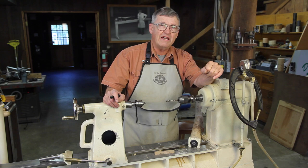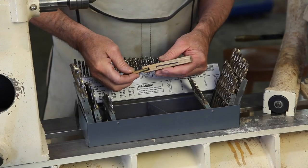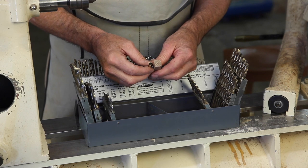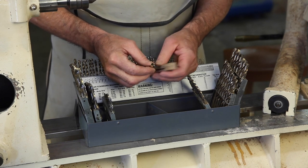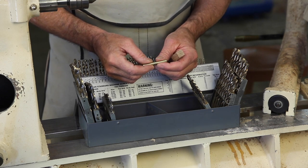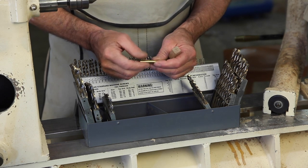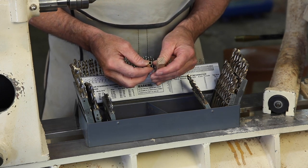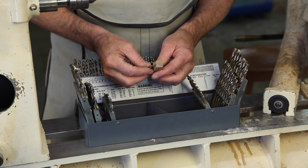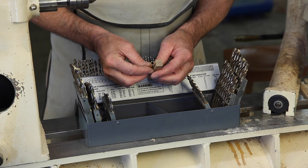In this video, I'd like to show you some things that you can actually do better on the lathe than off of it. Most pen kits require drilling of a center hole through your blank into which a brass tube is glued. The parts of the pen are then a press fit with this tube and the whole thing stays together. Center drilling this blank straight is problematic and a drill press is not the best tool to do this with. Your lathe will do much better.